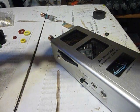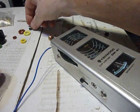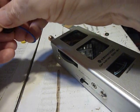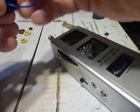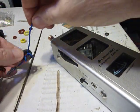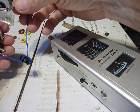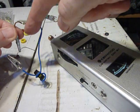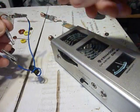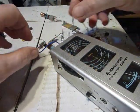I just wanted to show you guys these different cores and how you can check them like that — you can find cores you can use for RF out of your junk cores. Now here's a black one; I happen to know this is a yellow core with a hard-to-see yellow dot. I've got three loops through it. I just set this up with these little short jumpers with two clips, and the wire goes through the core, and then you've got the capacitor in series with the whole business. By doing that you've got something where you can quick and easy change these.